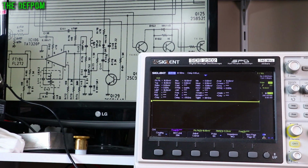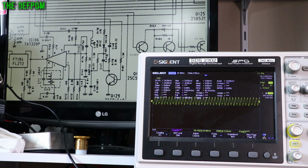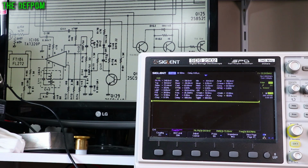And if I now go and measure on pin 2 of the TX mixer, which is up there, which is what we looked at before and didn't have anything there. Pin 2, let's go to transmit. There we go, there it is. Right, so previously we had nothing there when we went to transmit. We could see nothing. And if I do FM, exactly the same. Right, so FM was there before, although it was masked by the transmit waveform. Actually, I'll pull that carrier back out again. Let's do that. Make sure we're not getting noise from that.